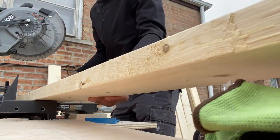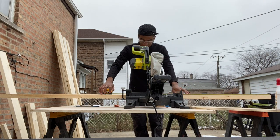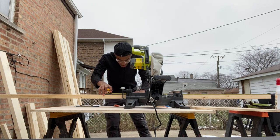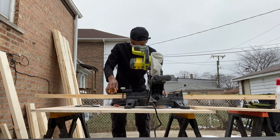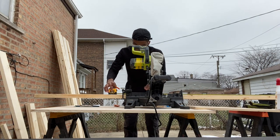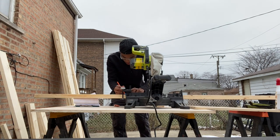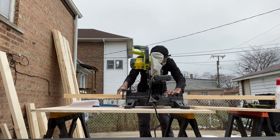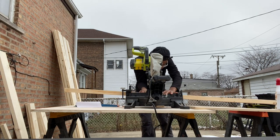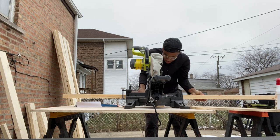Don't worry, guys. I'll be sure to put the plans for the floating bed in the description. So be sure to check. Measured it, got my speed square, made a straight line. Now it's time to cut. As you can see, I was having a little trouble because the board wasn't supported on the other side. If you can hold it, then go ahead and hold it, but you want to have something that could support it.